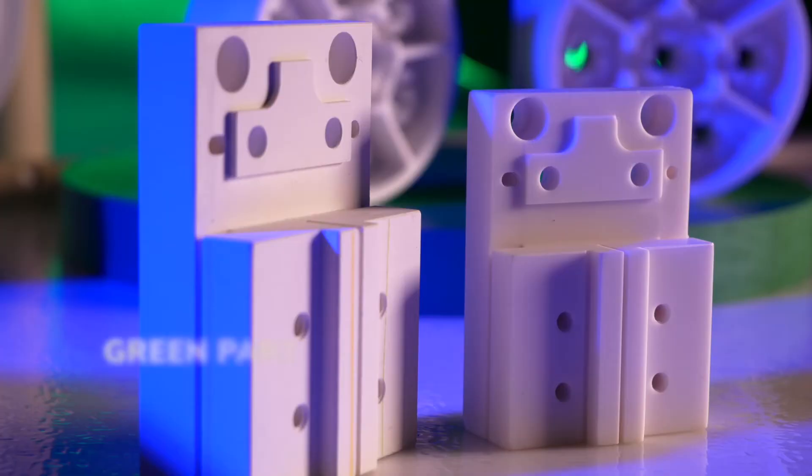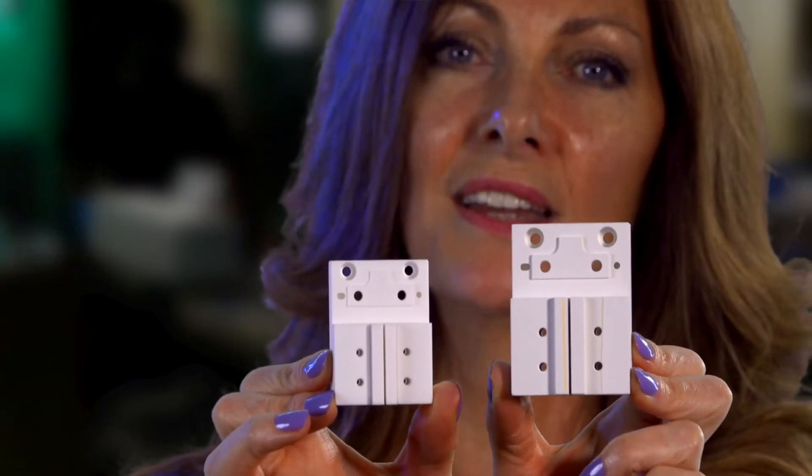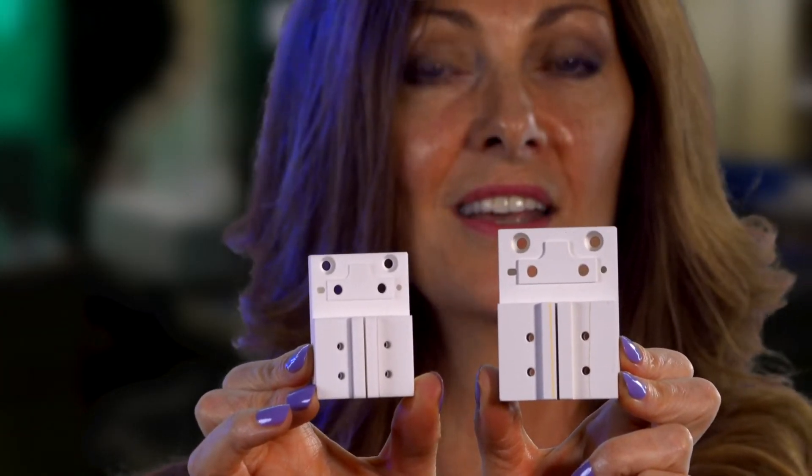Here's a fantastic example of what I mean by machining it green. This is a green part that's been machined before sintering. We calculate out the shrinkage rate and we fire the component in our kiln. We think we're very good at making complex shapes and we're also good at engineering out costs. There are many companies that don't have this technique, this capability or the knowledge, to be able to green machine the way that we do and have components come out of the kiln complete.